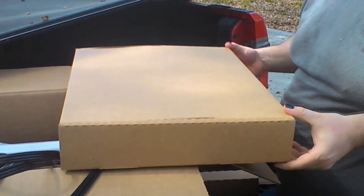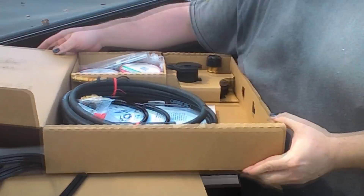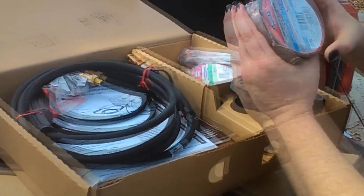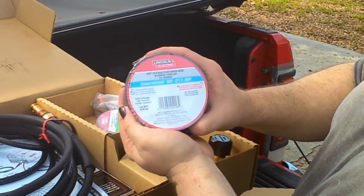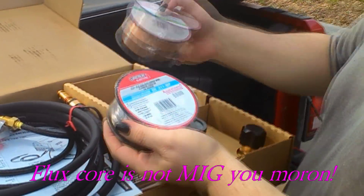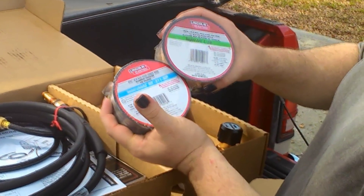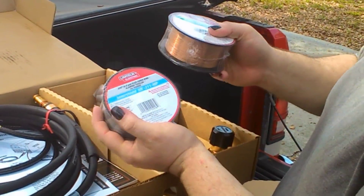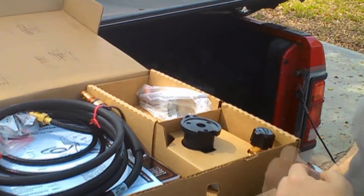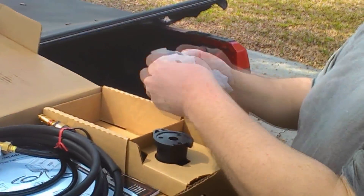In fact, she's been jumping around on this box with a very upset look on her face, like 'why can't I go in it?' So in here, inside the box, we have our MIG wire. This looks to be the flux core wire. We also have our regular MIG wire. 0.025 — that's actually good for doing sheet metal work. 0.035 — that's for doing stuff a little bit heavier. And we've got the ground clamp itself.